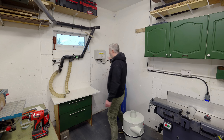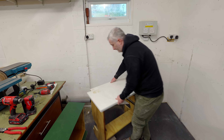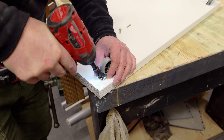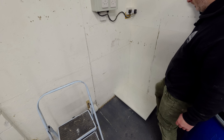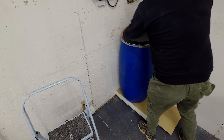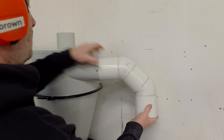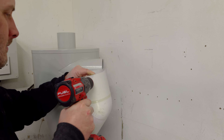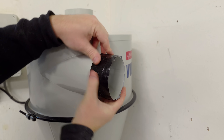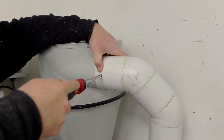I've cleared some space in the corner. First I'm going to make a mobile base with some one-way casters I had spare in the workshop. On top of that goes a four millimetre piece of hardboard as a temporary spacer, and on top of that goes my big barrel. The cyclone will sit on the lid of the barrel, and I've already made up a piece of 100 millimetre ducting stuck together with hot glue to help me figure out the position for where the cyclone will need to sit. This pipe was a bit of a loose fit on the cyclone so I'm using some duct tape as a gasket. The pipe I'm using is 100 millimetres and is generally used for ventilation systems.